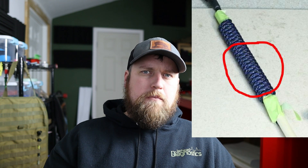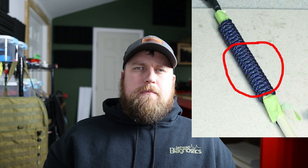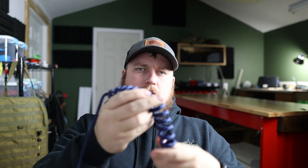Some things to note after getting this done in my first round with it. I had mentioned don't get the heat gun too close or you'll melt the sheathing. My first one, I melted the sheathing, so I actually had to swap my sheathing out. Also, in the video I said just leave it on for an hour — well, I left it on for an hour and whenever I took it off it was still kind of soft and didn't really hold that much memory in the wires. So I actually put it back on the dowel, reheated it, and let it set for 24 hours — an entire day. After that, the memory was a whole lot better. The longer you can let it set and develop that memory, the better off you'll be with the spiral.